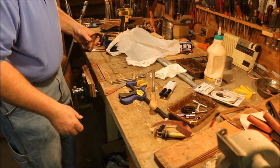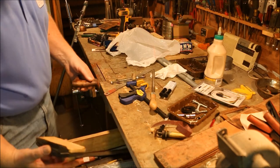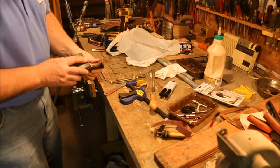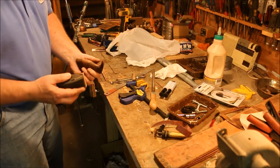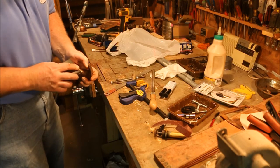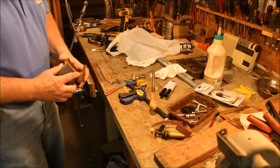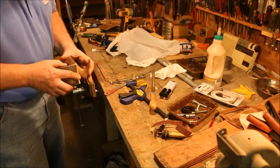The epoxy is set up, but it's still just a little gummy. So I'm going to let it set a little longer before I go after it with the sandpaper. But what I'm going to be doing is just sanding that down smooth, taking all the finish off of it. Because trying to match the finish on this part that I repaired is nearly impossible. I suppose somebody with a lot of time and skill could probably do it. But I think it looks better just having it sanded down and a new coat of boiled linseed oil put over the top of it,